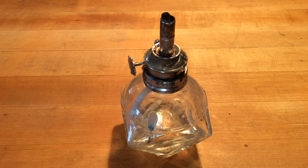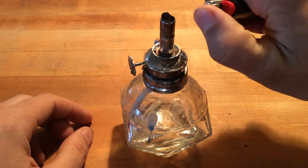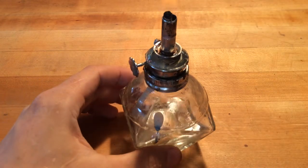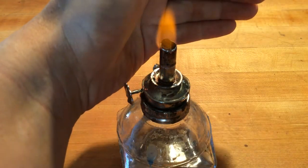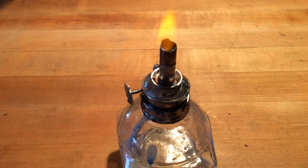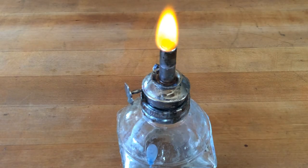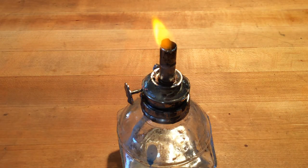At this point, all you need to know: you can either use matches or a wick lighter. Do not light an alcohol lamp from another alcohol lamp. You can see we've got a flame here — the lighting doesn't show up well on camera, so we'll just shut that off for a second. You can see how well the alcohol lamp is burning, and that will be hot enough for most of the operations we're going to do.